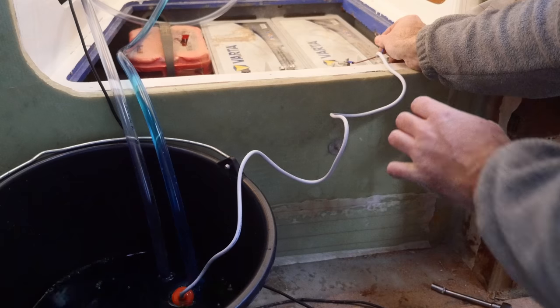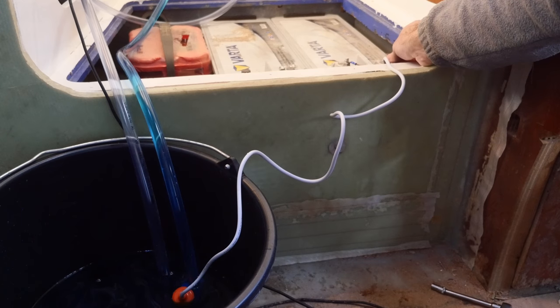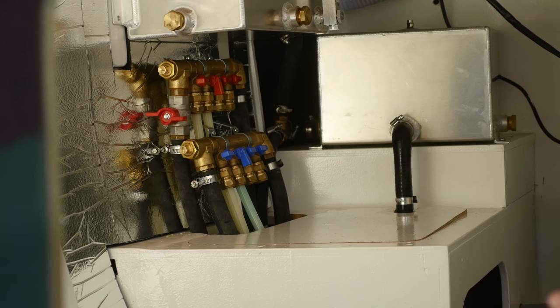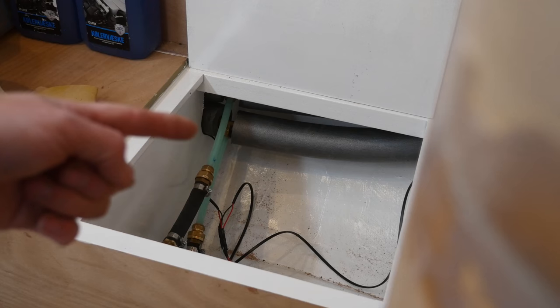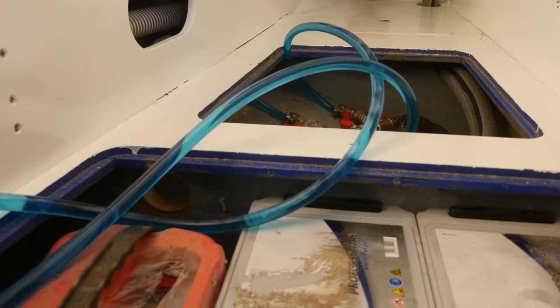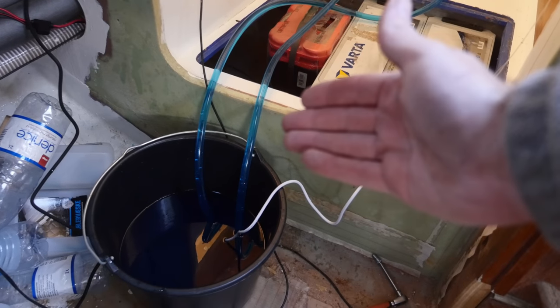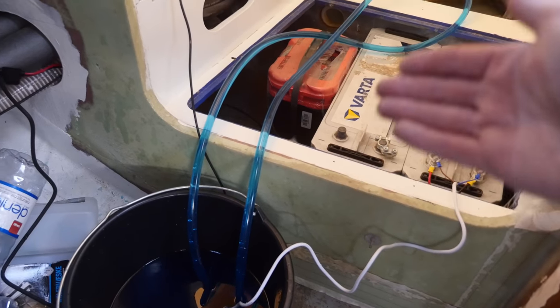That little pump turned out to be well pretty awesome — I can hear the coolant sloshing around in the system. You can see the PEX tube on the bottom manifold with coolant running through it, and the PEX tube has turned blue from the color of the coolant at the first fan heater. The coolant is coming back to the bucket. I'm leaving the pump running until there are no more air bubbles — after a few minutes, no more bubbles are coming out.